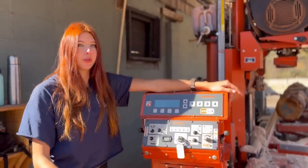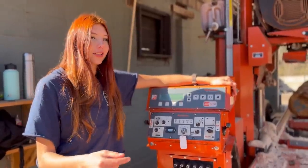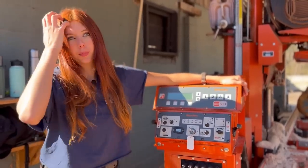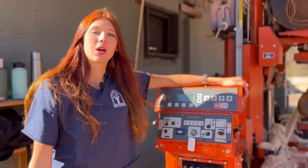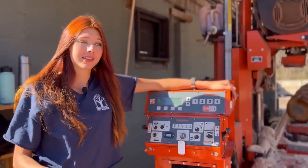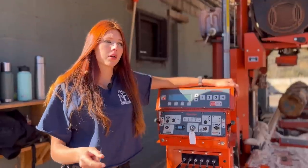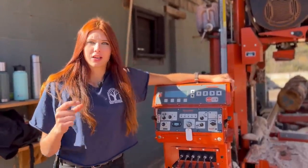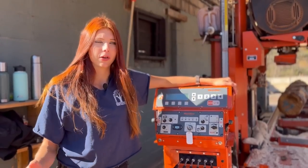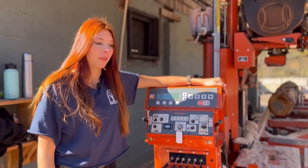For hemlock you can go a little bit faster; after any hardwoods you're going to slow down. As far as chatter marks, I've talked about different chatter marks — meaning you might have a tooth missing on your blade. I have received comments saying that means you're going too slow, but actually it doesn't. There are two different kinds of chatter marks. Chatter marks where one tooth is missing are going to be a little bit wider, whereas chatter marks when you're going slow are going to be really close together.